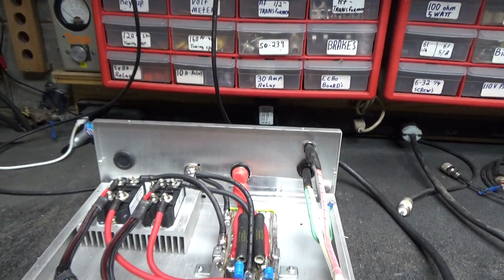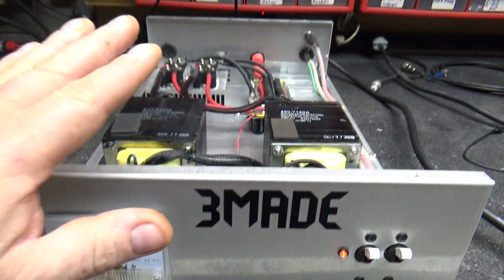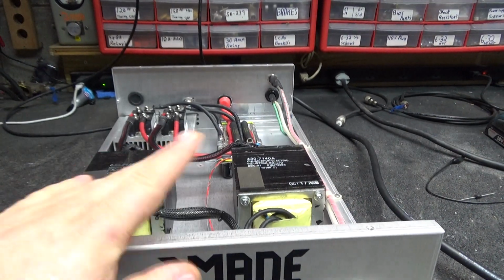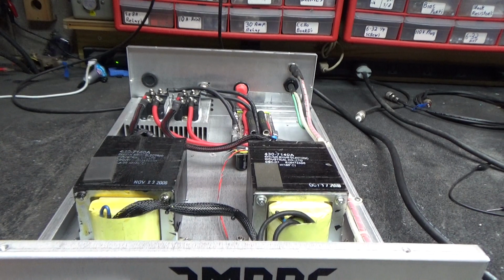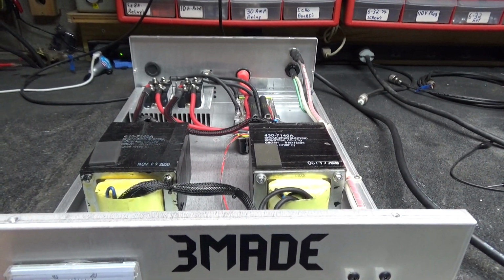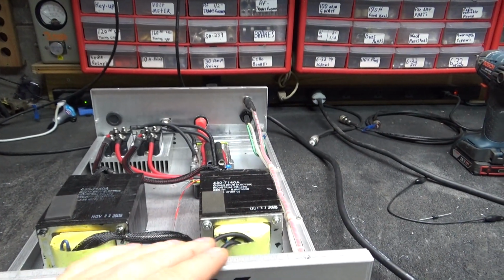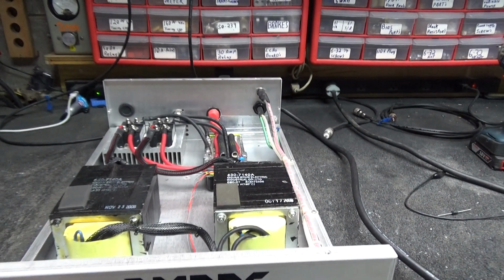And I pulled a load test on it, and it idles at about 18.4. But you know, this is iron core, it's going to pull down. It had my recommendation that I told him we could put switches in here, and he said no, just try to leave that in there and put another in beside of it. So that's what I did, and that's what we got. This thing is pulling down about 14.5 on 110. That's 110. If this thing was on 220, it'd do a little bit more. It'd be a little bit more solid, but it's on 110. That's where he wants it. It's pulling about 150 amps before it drops down to about 14.4.